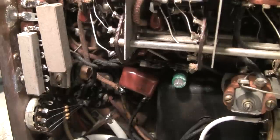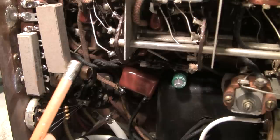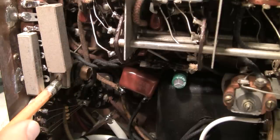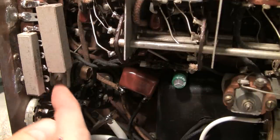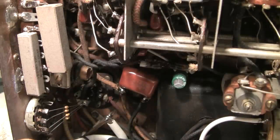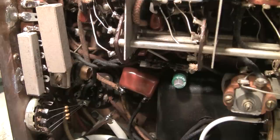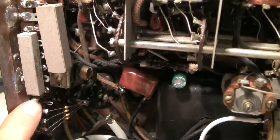I also didn't show you how to tune the wave trap, and it's a pretty simple thing to tune. Down at the bottom we see this capacitor here — normally these resistors aren't in the way, and if you watch the first video you'll find the reason why these resistors are here. How you tune this capacitor is you run a screwdriver down through here. Both of these tabs here are both grounds, so it's pretty safe to do that at any time. Once aligned you pretty much don't have to do it again. You turn this radio to the A band, tune the dial to 1 MHz, feed a 465 KC signal into the back of the radio through a 200 pF capacitor. It has to be quite a bit of signal — pretty stout. The attenuator is wide open, there's no attenuation at this point.